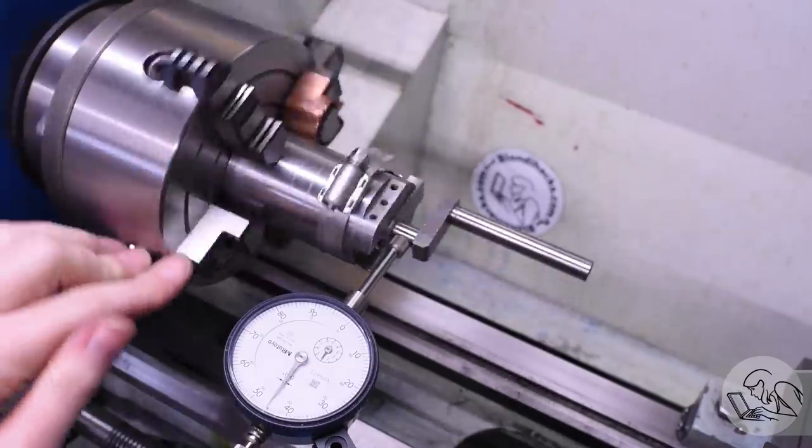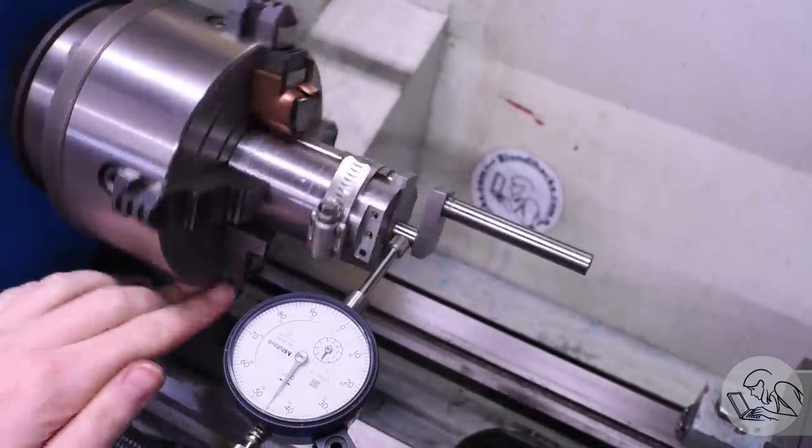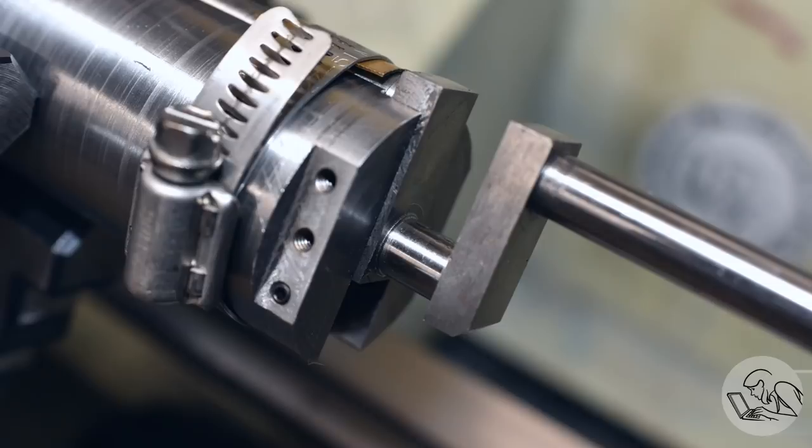And hey, whoa, what's going on here? Why is the crankshaft in the lathe in the fixture that I had made to make that crankshaft? Well, trouble afoot. See that little line right there? I thought that was a tool mark. And I thought the crankshaft was done. Turns out it isn't. That's actually a lip. So I did not manage to face the inside of these crank webs perfectly flat. And I had measured the inside dimension of them and it was correct, but I didn't measure all the way down at the shaft where the strap is actually going to sit.